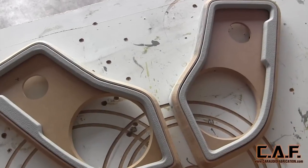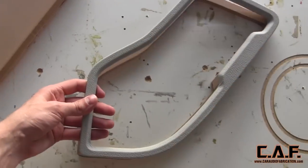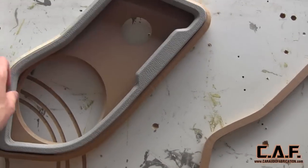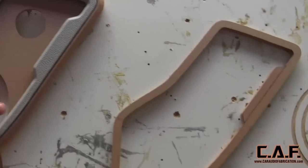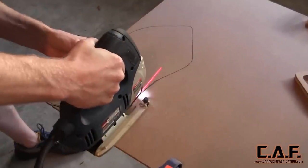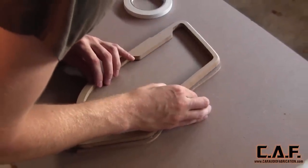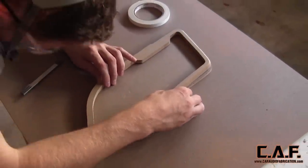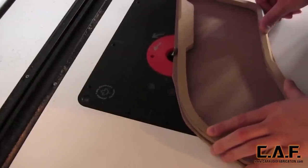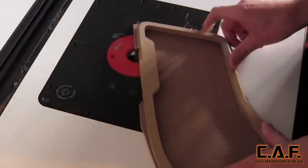In the previous video we finished wrapping our inside trim rings. You may recall that I mentioned making sure that you have a copy of that inside ring. This copy of the inside ring is our starting point for making our formed grill mesh. To start I'm transferring the outer profile and then rough cutting it out with a jigsaw. I then adhere my master template to this newly cut out piece with double-sided sticky template tape. Then using a router table I use a quarter inch spiral trim bit in order to flush trim the outside perimeter to my master profile shape.